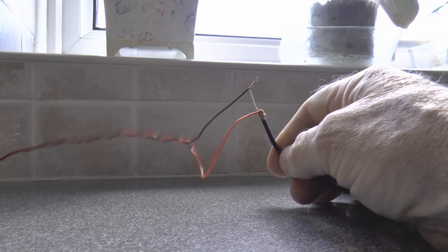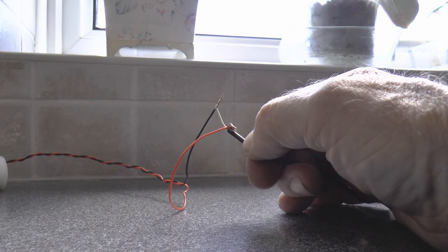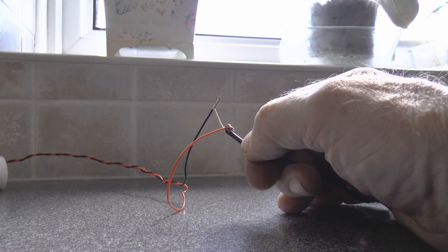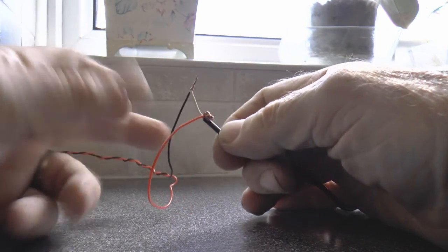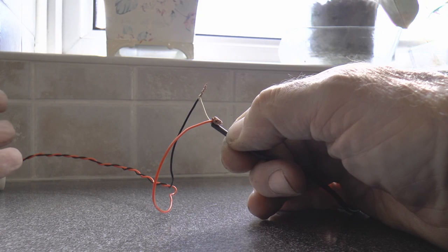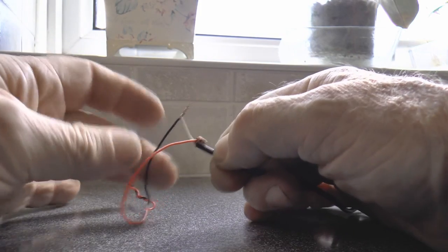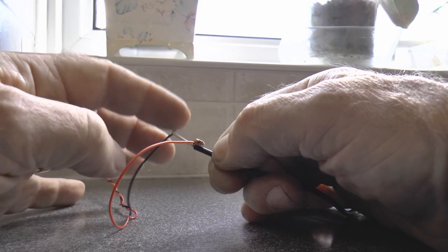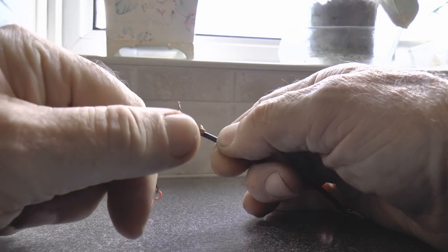It's half a volt over what the three batteries would have been at 1.5 volts, but it doesn't seem to have had any effect at all. The only thing I must point out is that I stupidly forgot that the back face of the battery is in fact the positive and not the negative. Consequently I connected all the wires up the wrong way round for colours. So when you connect up to the power supply, you need to connect your black wire to what would be the positive feed, and the red wire to the outer case negative feed.